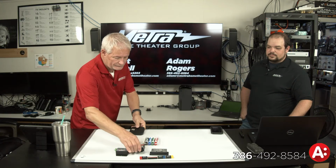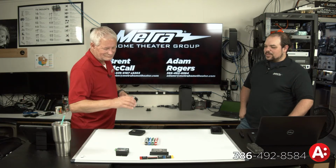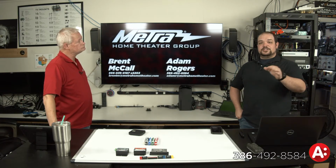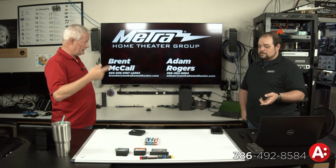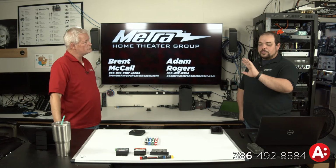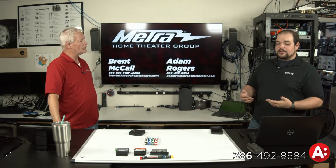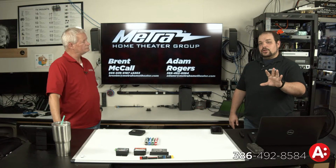That along with a DAD. And now see, here's the hard part about the DAD: unfortunately we don't produce it anymore. But I think we still have them in stock. I'd have to check. You contact your sales rep and find out if we still have them in stock, because it monitors 5-volt hot plug, EDID, and HDCP and clock. So with the source device and the DAD, the nice thing is it has the LED information that'll tell you: are you getting clock, are you getting the data, are you getting 5-volt positive, and are you getting hot plug? That is a good thing to know going forward.